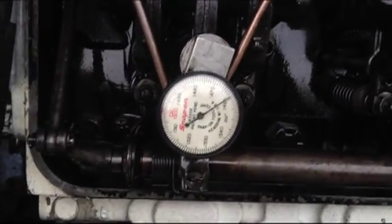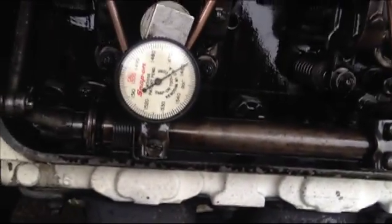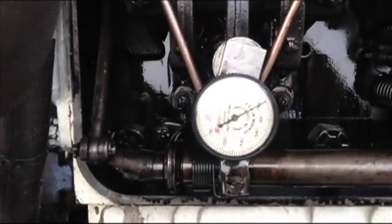The beauty of this is when you go to tighten it back down, usually you change it just a little bit. So you can make sure — while I snug it back up here — normally I would do this with two hands, but I'm going to do it with one for right now. You see as I tighten it, it went off just a little bit, so by watching that dial gauge I can make that adjustment as I go. If you're using the pin for the height, you can't do that — you don't have the pin on there anymore and you don't know if it gets off, so that's why you get off a little bit tightening at the very end.